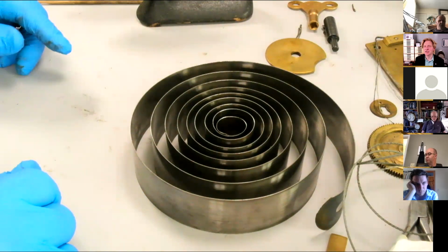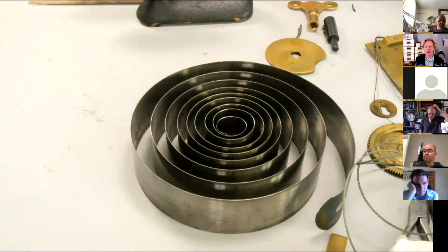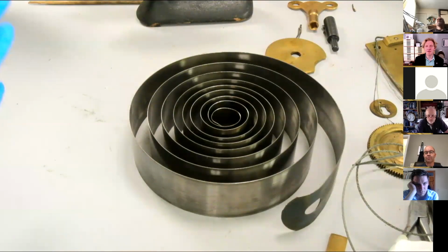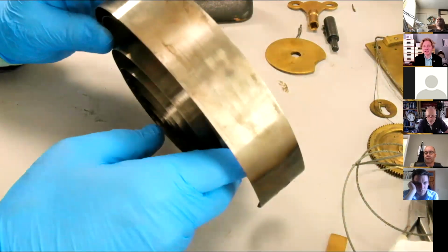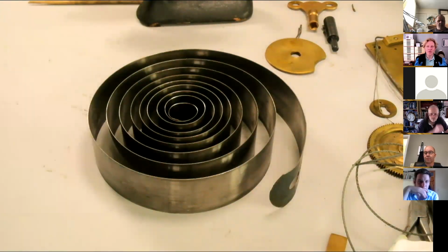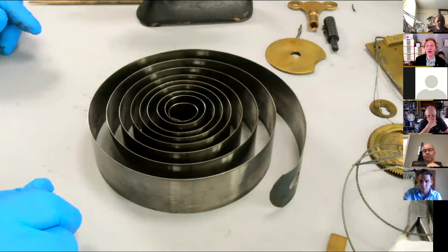I don't know, Debashish, the thing about why people replace springs, it's one of the, for me, and I know it's an unpopular view, but it's one of the biggest causes of the degradation of antique clocks there is. If you replace springs with thinner ones, because a spring like this is later and overdriving the clock, absolutely. But this idea about the spring being set when it's 2 or 3 times the diameter of the barrel, I just don't buy that one bit. Try it first and see what happens. I've no idea. I'm afraid you would have to ask those people what their justification is.